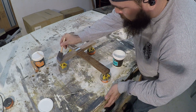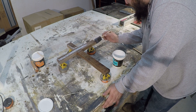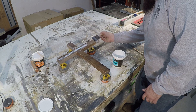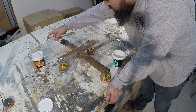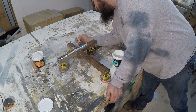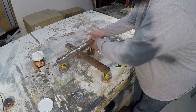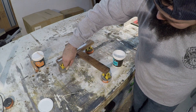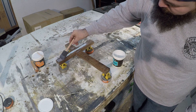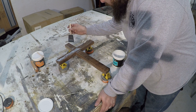On this piece I applied a couple of coats of the polyurethane off camera just to save some time — I believe I put five coats on this and I sanded in between coats. My shop's a little bit dusty so there were a couple of dust nibs here and there, but I would sand with 400 grit between coats and then finally I used a piece of white printer paper to finish-sand and polish up that semi-gloss a little bit, and it actually worked really well.